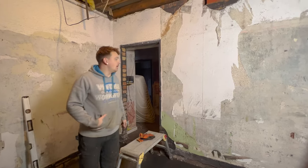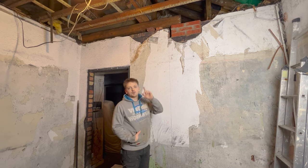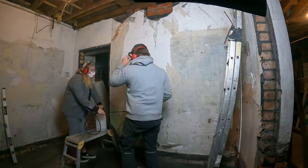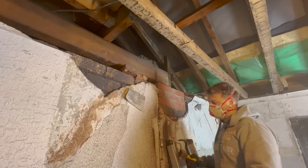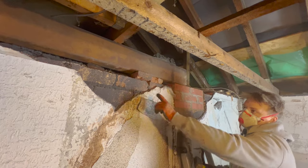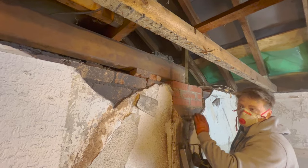Another night after work - I've marked out my line where I need to disc cut. I'm going to get the water suppression bottle, mask up, Natasha's going to mask up with ear defenders and goggles, and we're going to disc down this wall and start taking the brickwork out. We've cut through here - it hasn't gone all the way through, probably about two thirds, but that's good enough to snap the brick. This is the padstone and these are my brick packers to hold it up. All I'm going to do now is start taking the brickwork out - it'll drop down and sit on the padstone with about two or three mil to drop, then we can take the rest of the brick wall out.